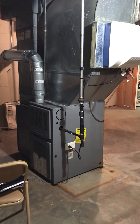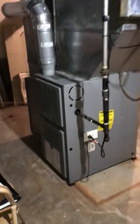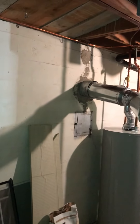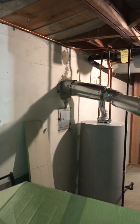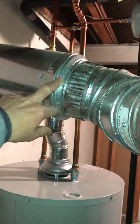The furnace looks like it's from about 2005. You can see the gas is right there for us. The isolating valves are high up and the electrics are in a metal conduit. The liner's been dropped down the chimney — it's quite a big one, a seven-inch liner, and then it tapers down to a five-inch flue. This looks like a seven-to-five, so I guess we'll be going from a seven to a four.